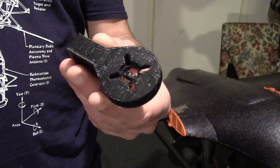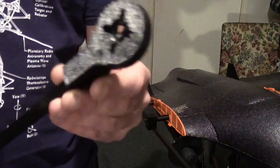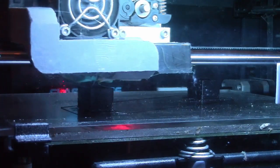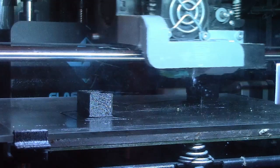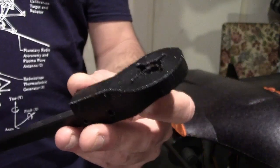The actual motor mounts are something I designed a while ago and I've used on a few different projects. The nice thing is that they'll just slide onto the carbon fibre tube and there are a couple of M3 bolt holes so you can fix them in position. I always print motor mounts out of nylon because it has a higher plasticity temperature. I've actually had drones fail in the past because when the motors get hot, a low temperature plastic like PLA gets soft and can actually fail.